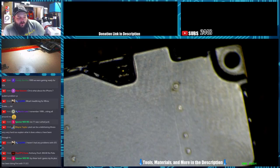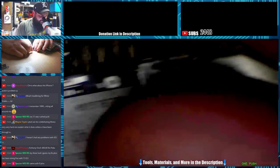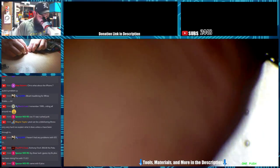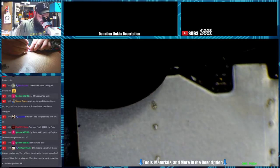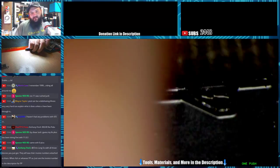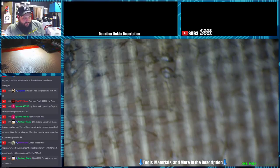The microphones weren't working. The speakers weren't working. We replaced the audio IC twice, and both times we would get audio one time. You could reboot the phone, then there would be no audio. So, it was on iOS 11. He asked, is there anything with the screen that could cause this? I highly doubt it. Maybe if you hit one of the lines, like an I2C data line or something. But I looked around, I couldn't really see any problem with them.